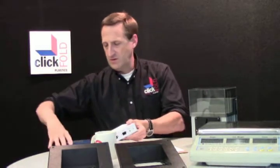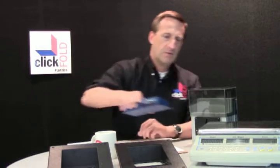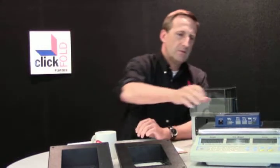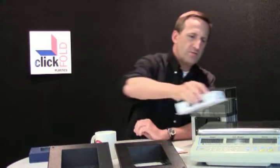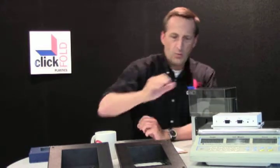Let me get to another very important aspect, which is the aspect of weight. This sheet metal part weighs in at pretty close to a pound. Compare that to the plastic version, which weighs in at about 0.4 pounds — a 60 percent weight reduction.